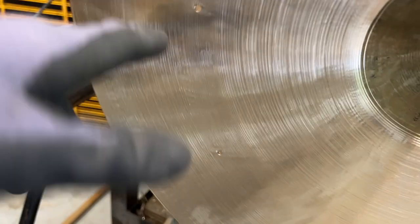What that does is, if you have a sharp bit going into the hole, obviously you go in and you start to chatter. And even with my wide bit, there is some chatter. You can see right there around that hole. There's a little bit of jumping that happens, but I want to minimize that as much as possible. You can see a little bit more of it there.